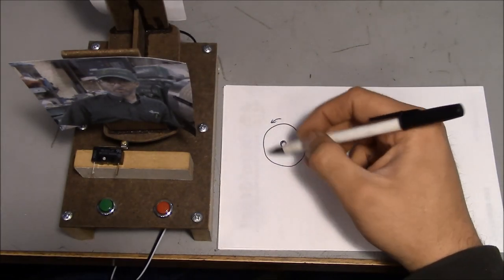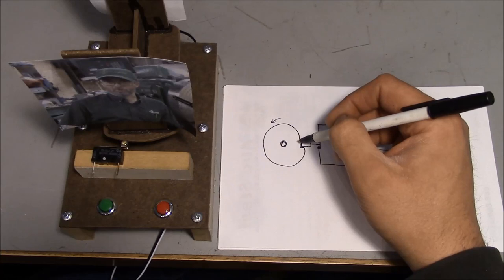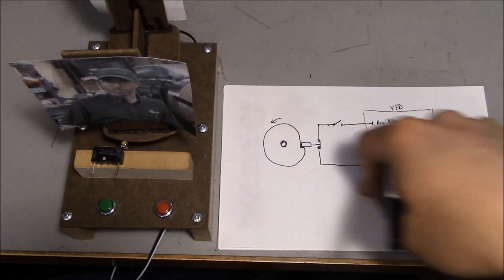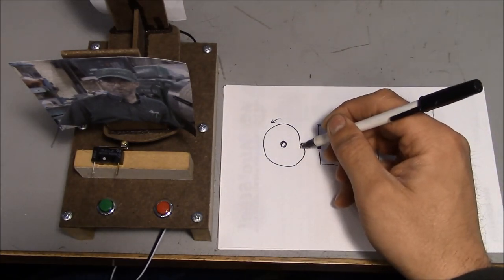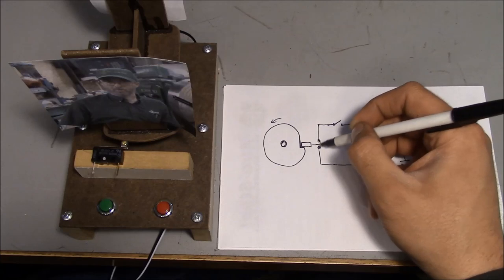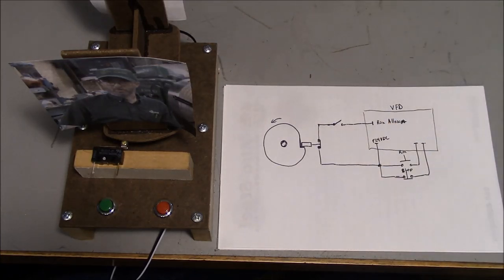It's basically a vertical stroking shaper that's designed specifically for cutting gear teeth. And the whole thing is kind of controlled by a big cam. And the cam sort of sets the depth of the cutter. It takes a rough pass and then a finish pass and then a fine finish pass or whatever. Anyway, when it gets to the end, the cam has a kind of a divot in it, and it kicks the tool out of the work, and then it also allows this limit switch to close. And when the limit switch closes, it's supposed to shut down the motor for the machine.